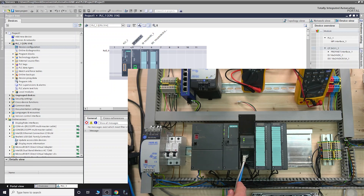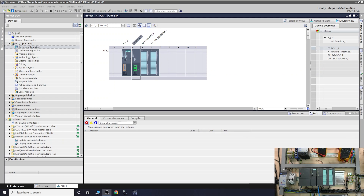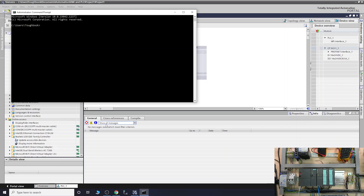The white cable goes straight to our network and the blue one connects directly to my laptop. What we're going to do is unplug the white one and communicate using the blue network cable connected directly to the laptop. One thing to make sure is that our IPs are within the same subnet and the same network. If you go into CMD, it's always good practice to keep everything within the same network because it just eases communications.